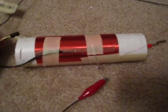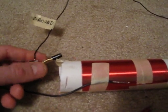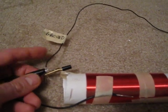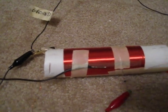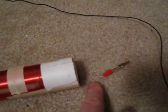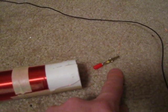That sanded area is going to serve as a hookup point. On the bottom end of the coil, I've sanded off the enamel and soldered on a little alligator clip with a black plastic piece — that's the ground connection. On the top end of the coil I've done the same thing, sanded the enamel off and soldered on another alligator clip with a red plastic piece. You can also burn the enamel off with a cigarette lighter if you don't have sandpaper — just make sure you get a nice electrical connection.